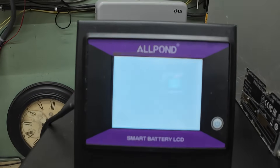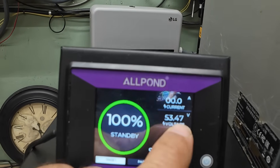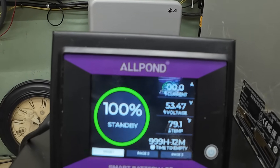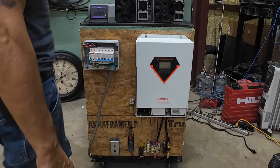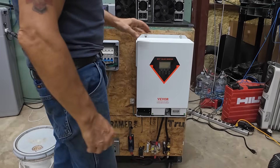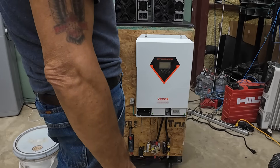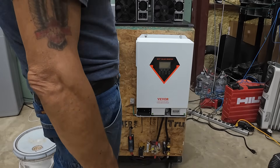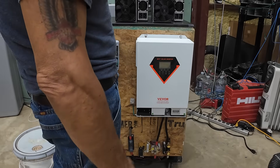I've got a full charge on the battery — let me make sure, yeah, 100 percent. The voltage is a little bit low, I gotta adjust that, so next run I'll set the voltage a bit higher. After we get this initial startup done, I'm gonna take the cover off and put an IR camera on it. I'm particularly curious about the IGBTs and what temperatures they'll be running at. We're only pulling about half the inverter's capacity with one miner, so hopefully everything goes all right.